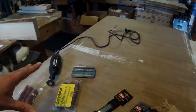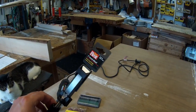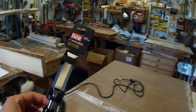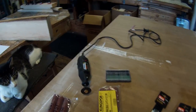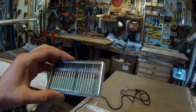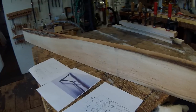You need something called a tooling grinder that runs at a slower speed and shoots a water jet at the steel so it doesn't overheat. This steel is already hardened, so if it overheats it becomes really brittle and it won't hold an edge when you sharpen it. So I have to rig something up so that I can cool the steel as I'm cutting it. I'm just going to use a grinder wheel on my Dremel. I also have some diamond tipped small bits I can try. So after I have my scraper chisel done, then I can start making this pattern.